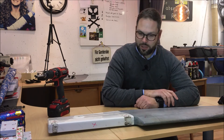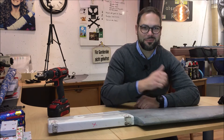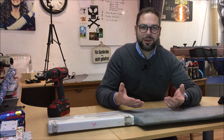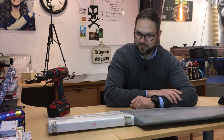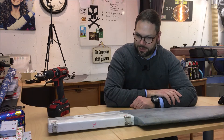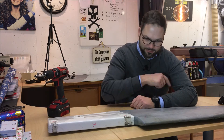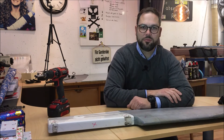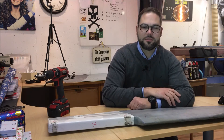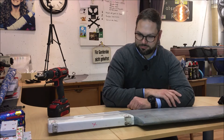In the second step I will take my split molds and apply a minimum of 10 to 12 coats of release agent. This is extremely critical so that at the end I can get the ready carbon parts out of the mold, because I have to use the mold at least twice to produce two rudder plates for a double rudder steering system. After applying the release agent, I will make a pattern out of plastic foil, cut the different layers of carbon fiber with it, put them in the mold, and then infuse with resin. So let's drill some holes.